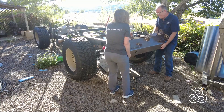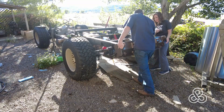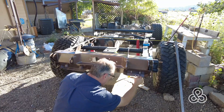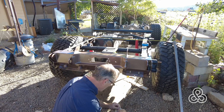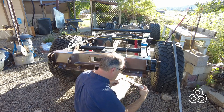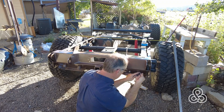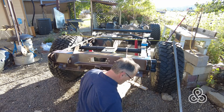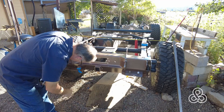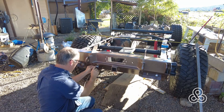You kind of have to put it in at an angle so that bottom bracket swings around the crossover tubes, but once it gets in position it flips right up and lines up with that plate so those bolts go through and hold it. Here's one of the things I added that didn't get to see in the video: I put some stainless steel plumbing nipples welded through the lower side of this bumper for some drainage systems. Over here I put some half-inch nipples, but then I found out as I'm going to put it on that somehow I ordered three-quarter inch fittings, so I guess I'll have to reorder that.